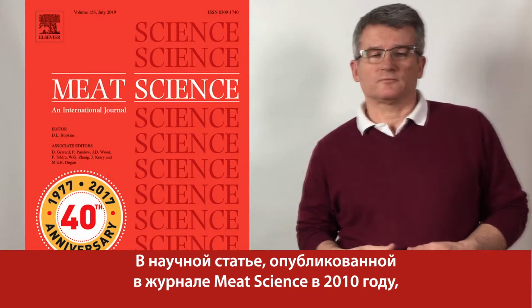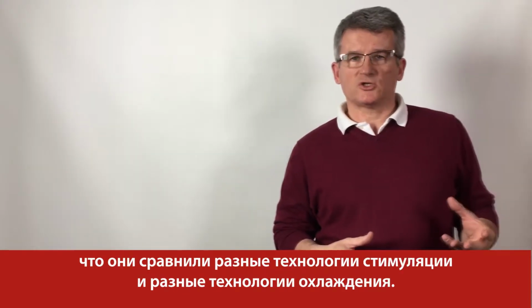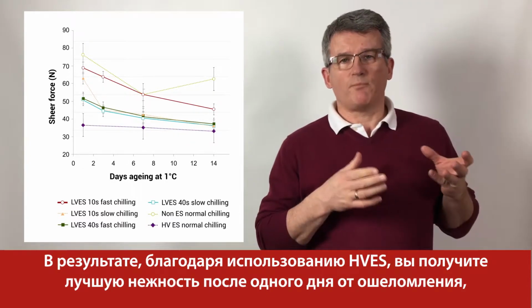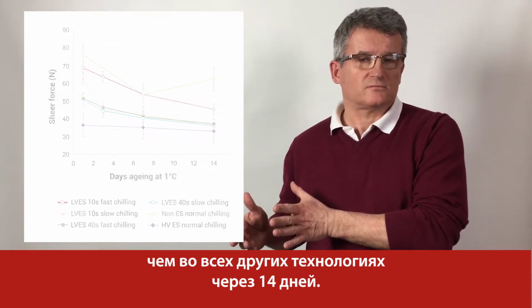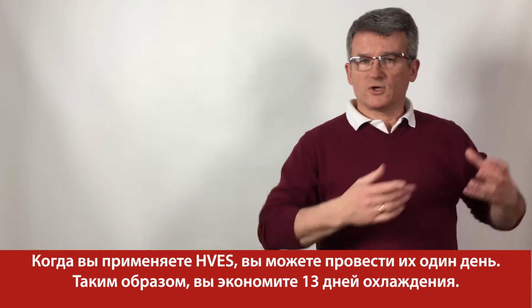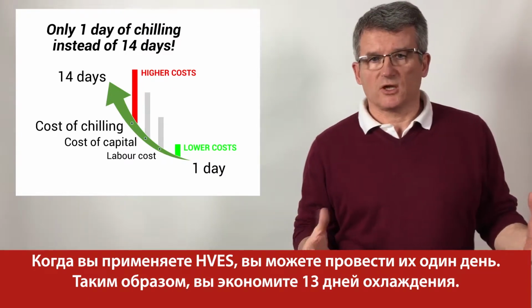In a scientific paper, published in Meat Science in 2010, Professor Devine and three other gentlemen compared different technologies of stimulation and different technologies of chilling. The result was that with HVS, you received better tenderness after 1 day from the stunning than in all other technologies after 14 days. Imagine you hold your carcasses in your chilling room for 14 days to get good tenderness. When you apply HVS, you can hold them 1 day. So we economize 13 days of chilling.